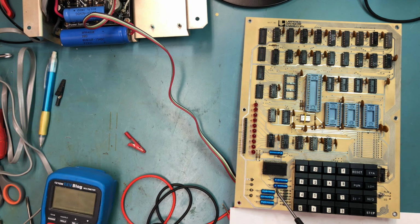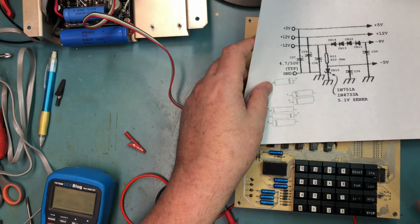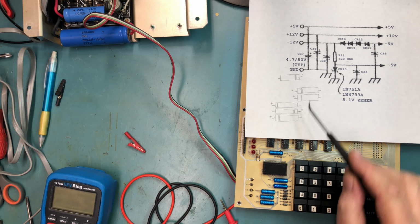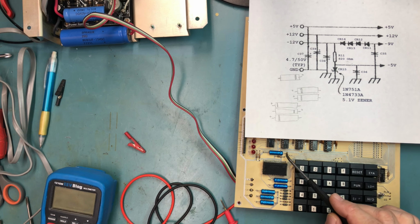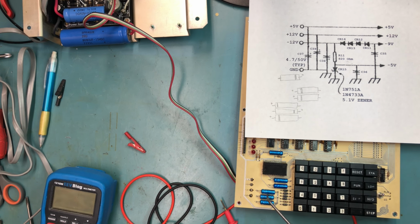There's a couple of capacitors here, and of course one up here. I think I'm just going to remove all of these, and we'll test them removed from the board and go from there. I have drawn out the orientation of the 6 of them. So the band is here, and there's a plus symbol there. The bands are over here, and there's plus symbols on the board over here. Band, band, band, and plus, plus, plus.